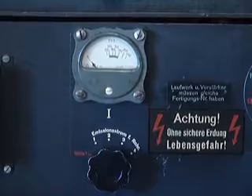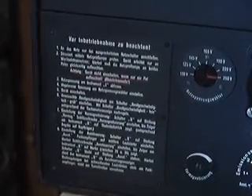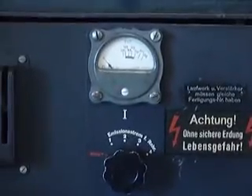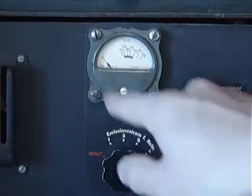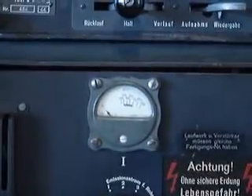There are a list of instructions on how to operate this machine. Down here you have a list which tells you basically the starting functions of the recorder. Basically what it says is to make sure the machine is on the off position, and then set this controller to network or mains input voltage, and then that will tell you up on this meter exactly what voltage is coming in.